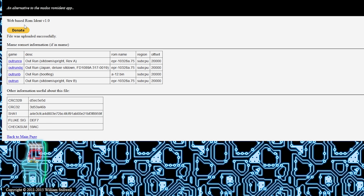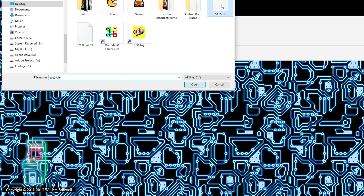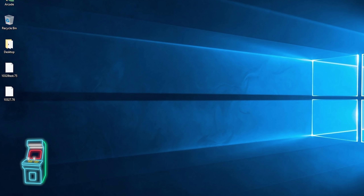You can donate to this website - it's really good, I use it all the time. Let me go back and check the second file, 76. Hitting submit - this one is also found, so the checksum checked out. That means it's probably a good file. Again it's a sub CPU area, so since we swapped out with good ones from the other version, I think something is going on possibly with the CPU. I wonder if I should swap the CPUs out first before doing all that desoldering with the RAM.